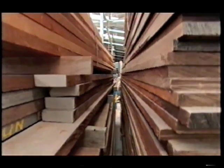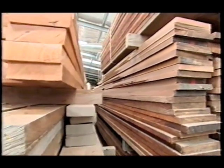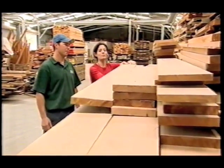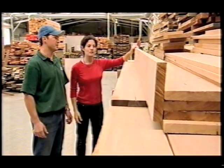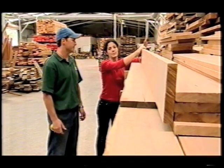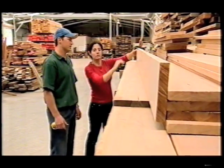Laura's back at the timber yard looking for the right wood to use for the screen. It's an indoor piece so it's not going to weather in the same way. As there are no glued joints, she's able to use timbers which are traditionally difficult to glue. Some of these timbers have what some people would consider faults — a big range of colour difference or gum veins through them — which in the case of the screen is going to give it much more visual interest. Black butt would be fantastic for what you're trying to do. I thought I might put a little bit of China wood oil on it, but no nitrocellulose or polyurethane. The other thing I need is to know that the boards are going to be really nice and straight — and that looks good.